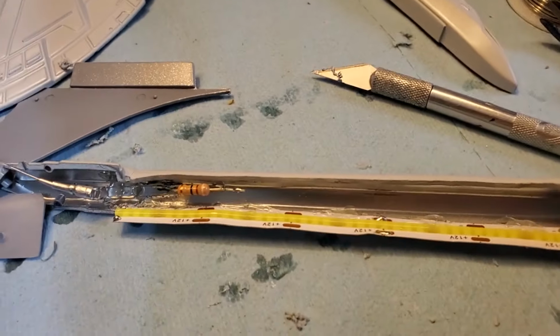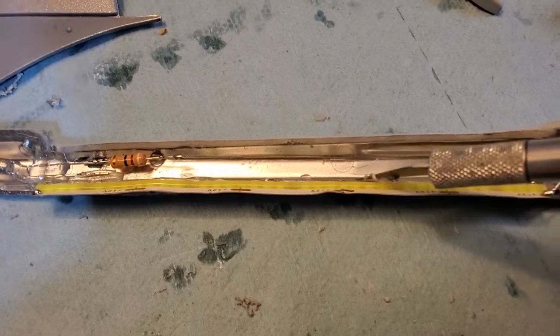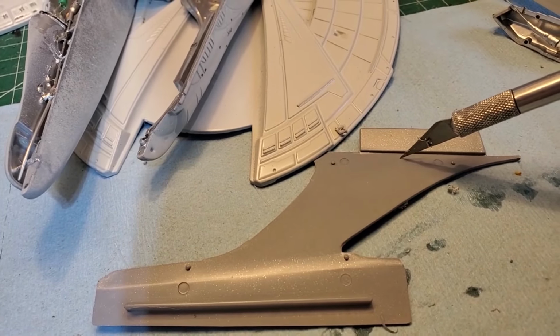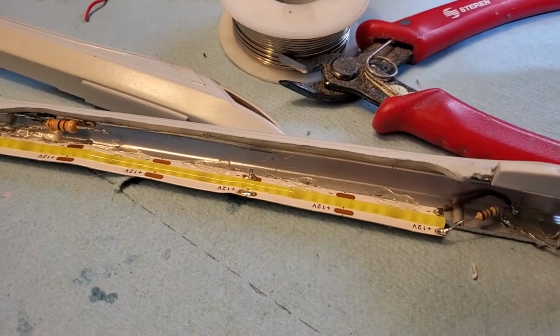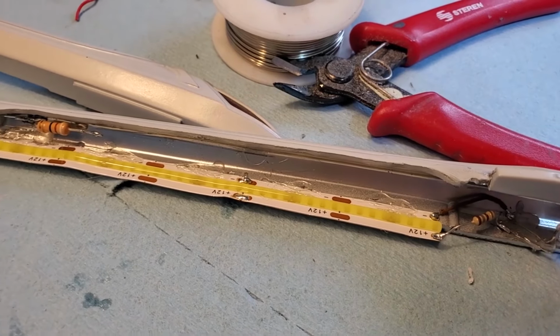So be able to run the wires. What I'm going to do is I'm going to drill a hole just off to the side here. Right around here. Which will go down here. So I'll probably have to make a little gouge in here for the wiring to fit down. I'm going to use the thinnest stuff that I have. So first I'm just going to drill that hole, and I'll drill it on an angle so it'll be easier to run the lines.